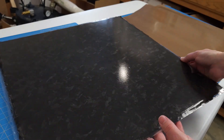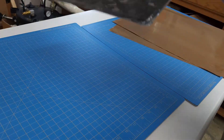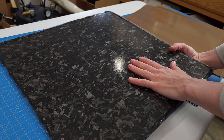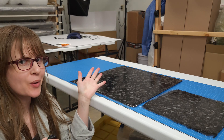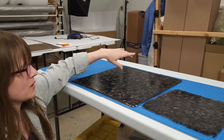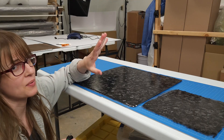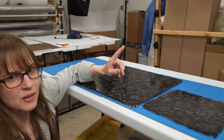This side's good — I don't think we have any pinholes at all. So now the question is: once I sand this to get rid of the veil, what's the pattern going to look like? Is it going to look as pretty as this pattern but without the pinholes? If so, then just adding that carbon fiber veil onto every side for forged carbon fiber might be the key. I'm just not sure yet. These are going to have to post-cure for at least another week before I can do any more testing, cutting, sanding, and all that. Definitely the one in the vacuum bag had way fewer pinholes. This one has so many pinholes, and it's a good option potentially to use that veil — I just have to see how it comes out if I sand into it. That definitely gave a much nicer surface finish. Good test — all done for now, we'll check back later.